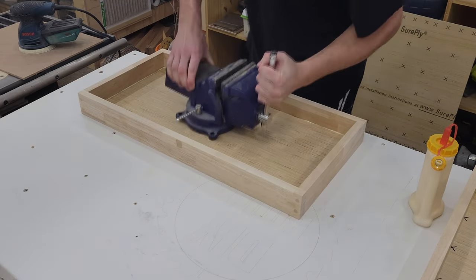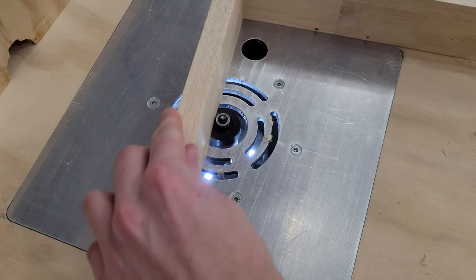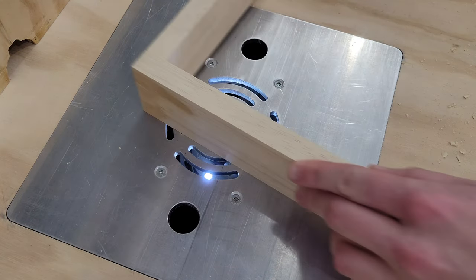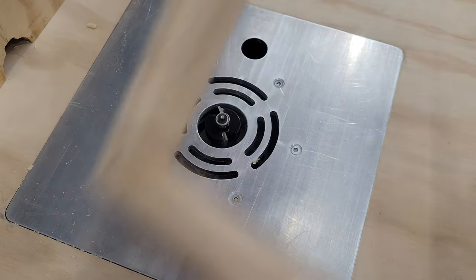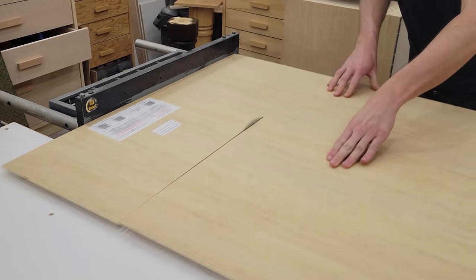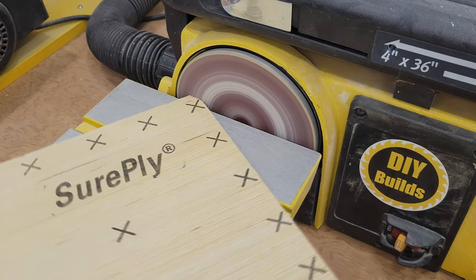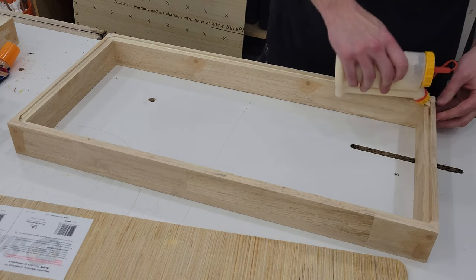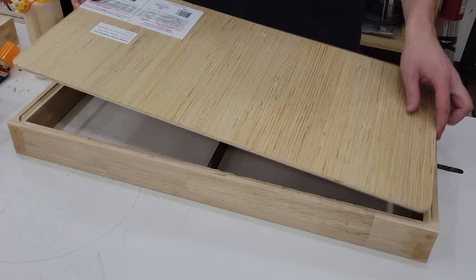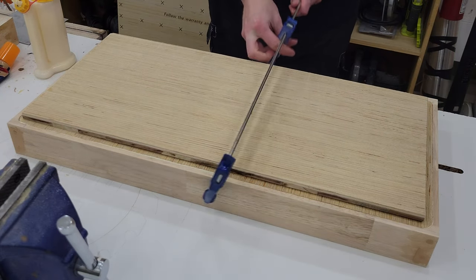I put some weight on it and clamp the edges to dry overnight. Now at the router table with my rabbeting bit set up, I take the wall-mounted frame and cut a rabbet in the back to accept more quarter-inch plywood to act as the back. I cut a matching size piece of plywood and at the disc sander round the corners to match the rabbeting bit. I then add glue along the whole perimeter of the rabbeted back, but before placing the plywood down I add a spacer in the middle so the sides don't collapse in as I apply clamping pressure, and let it dry overnight.